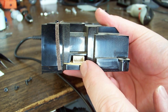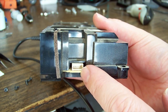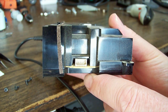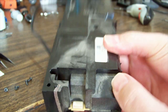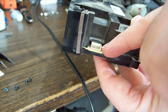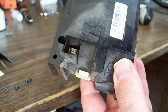So there's a few pins in here and I'm just going to probe each one. I'm gonna see if I can find a ground first. One of these will be ground, so we can do a resistance measurement between these and that heatsink, for example, which is probably ground. If it is the output, I'm pretty sure it's the output, but actually, no, we could use one of those two to find the ground, because we're 12 volts, but I don't think it's 12 volts on here, so we'll be able to go from here to one of these, and they should connect through. The other one won't connect through, because I think it's only like maybe 3 or 5 through here, control signals and whatnot.